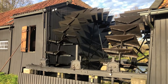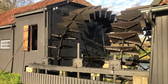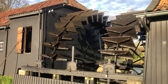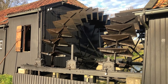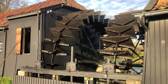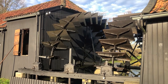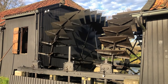Once the water current starts flowing, the water wheel will start turning, but it will not turn fast immediately — it will very gradually pick up speed. And this is like a coil. If you put a current through a coil, the current will not start flowing immediately either; it will also very slowly pick up speed. Here the energy is stored in the momentum of this huge water wheel. In the case of the coil, the energy is stored in the magnetic field. Totally different principle, but it works exactly the same way.